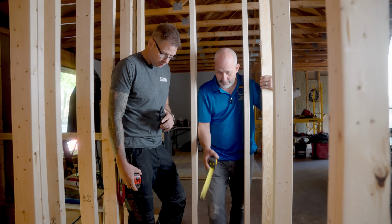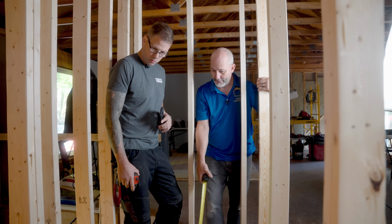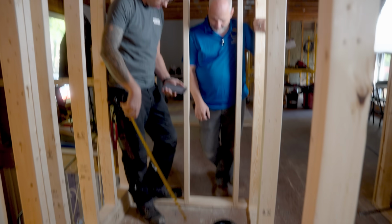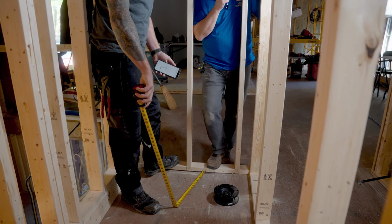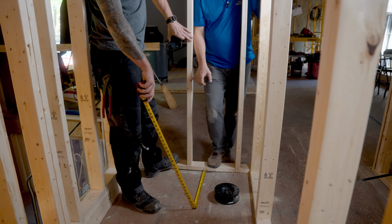So explain to me real quick what we have to do to bring this up to code and satisfy a toilet and a sink. Yeah, pretty simple. This is basically the most basic that you would have. Just a standard toilet right here. Based on your plan, your powder room allows for the toilet and the vanity here. And typically you want to be somewhere between 12.5 and 13.5, depending on what the clients are going to do on the back wall.